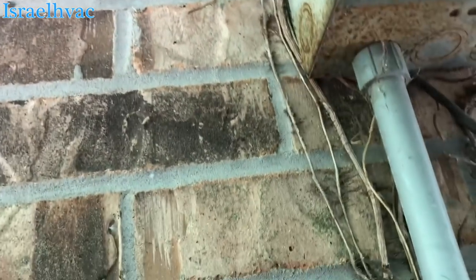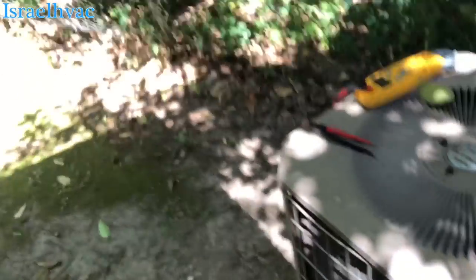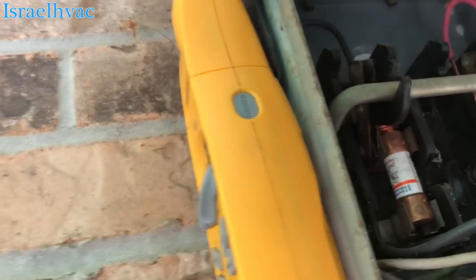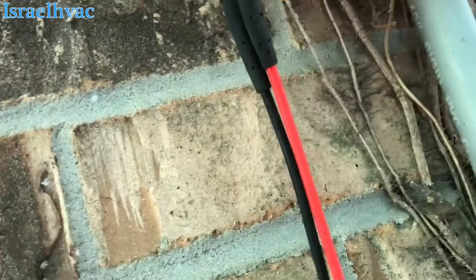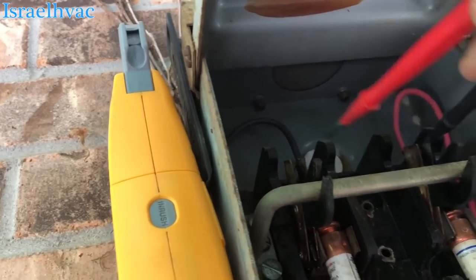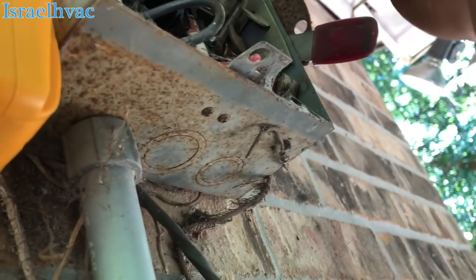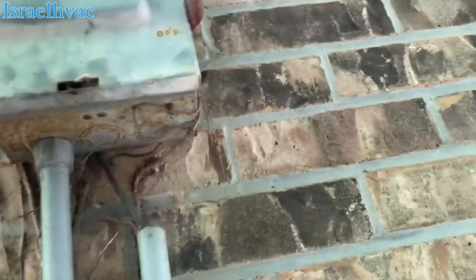Alright guys, I've got two new fuses in there. I bet it tripped the breaker — that's exactly what's going on. Back to the top. Hard to do with one hand guys, bear with me. I dropped one of my leads. No power. It burnt my fuses. This one's good, but it burnt that one. Damn, compressor's grounded.